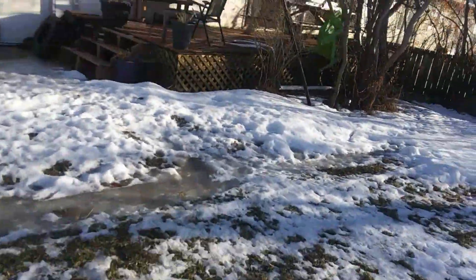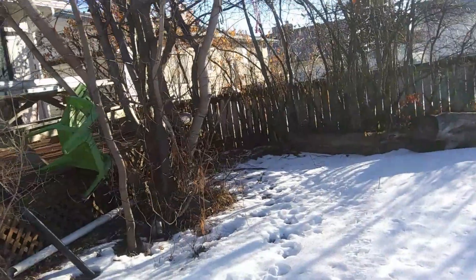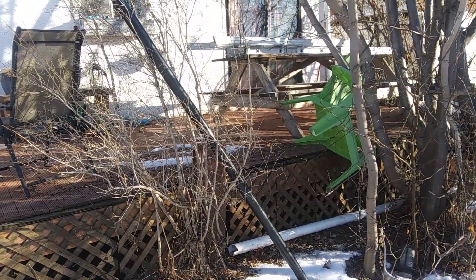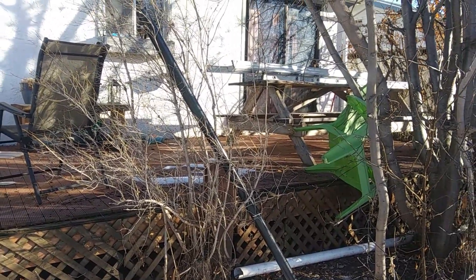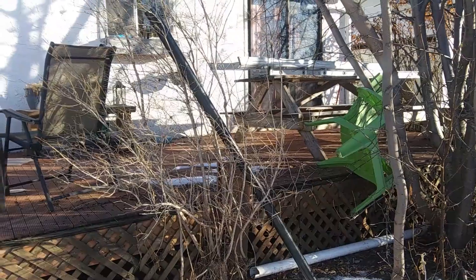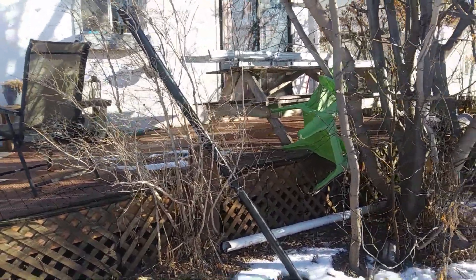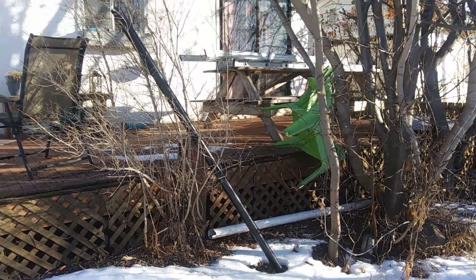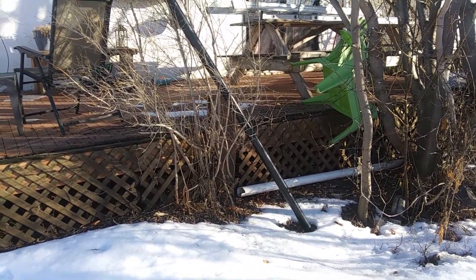And here I got the spray bar — a chunk of section for the spray bar. I'm going to try to make a new spray bar because I broke the one a bunch of times last year. And I'm going to put a guard in there so hopefully no flat rocks can get in between the grouser bars and the spray bar and break it again. That was the only problem — those medium-sized flat rocks were breaking it.